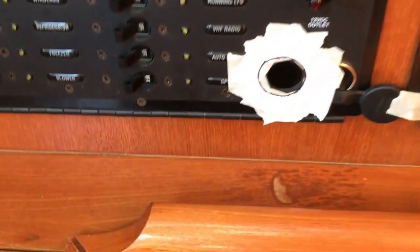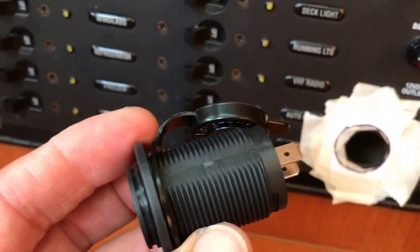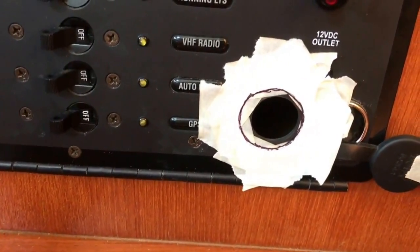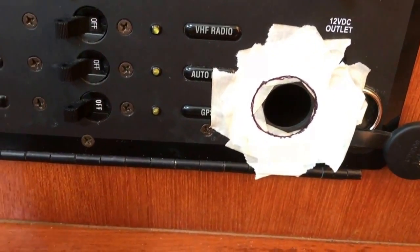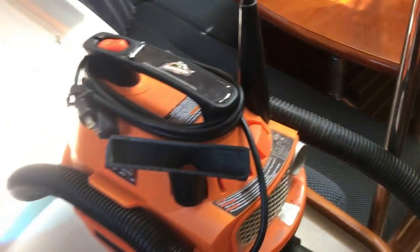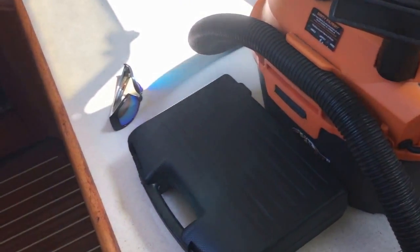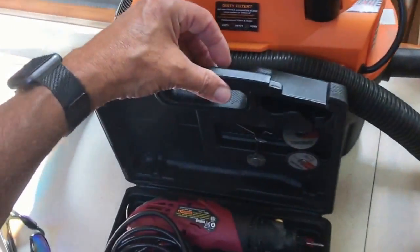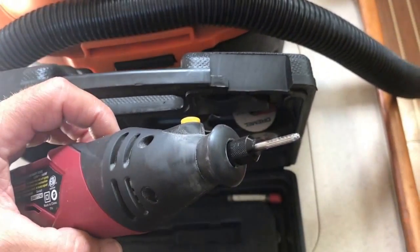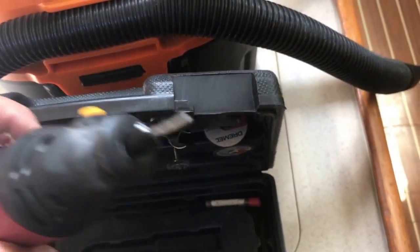As you can see, the hole size is a little bit different — it's one and one-eighth inch. I made a little template and sketched around it so I can open up that hole carefully with quality craftsmanship and make sure it fits. What I've got here is a Dremel tool kit and a vacuum cleaner, because the dust is going to fly all over. I'll use the Dremel with a grinding burr and go carefully around to relieve that material.